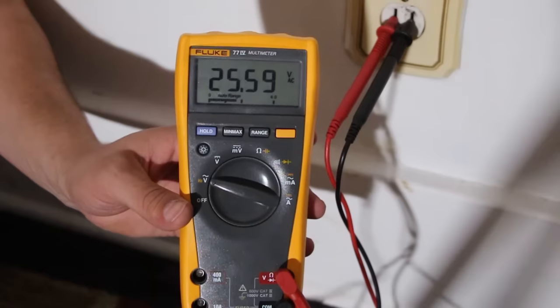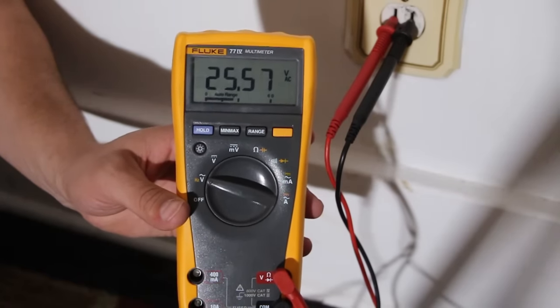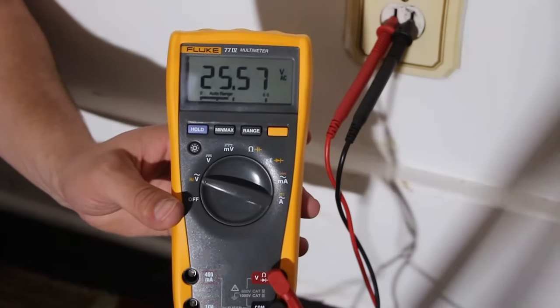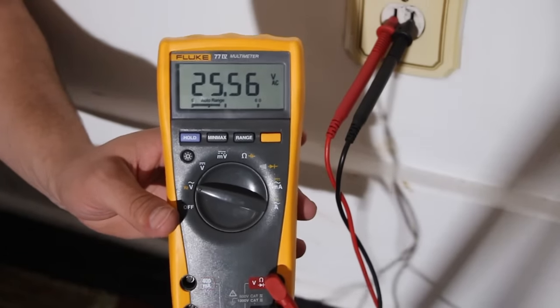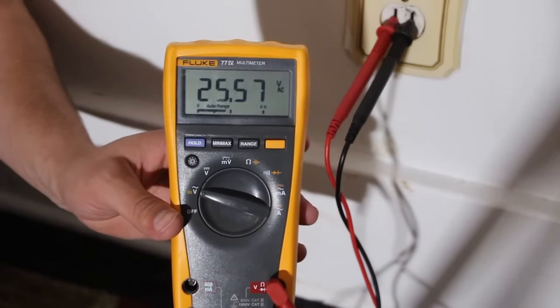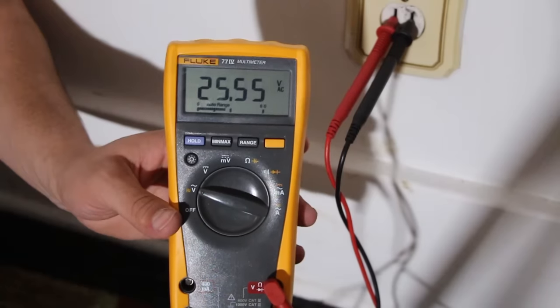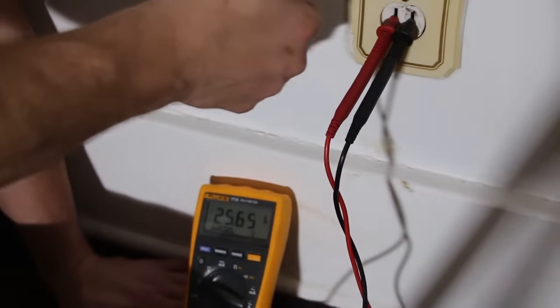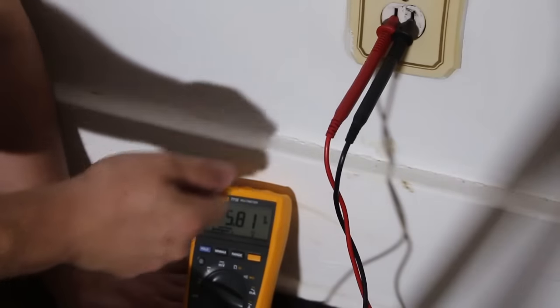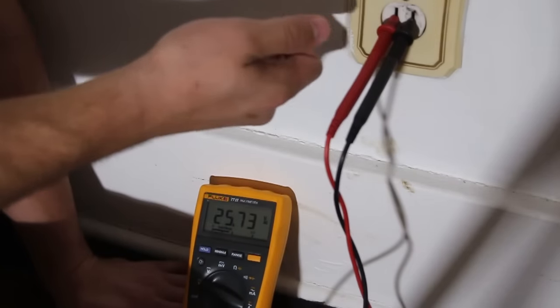Obviously, this receptacle either needs to be replaced, or there could be a grounding issue, or the switch on the other side could have grounding issues. This can cause issues not only with electronics in general, but also with safety. Fluke and other companies make a probe tester to see if there's voltage, and all it does is light up and go bzzz, or beep or blink.